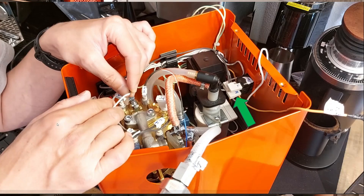What are the things you may forget if you just read the instructions? First, I think it's very useful to have flag connectors because they make a 90-degree angle and it's easier to route the wires in some cases. But to crimp flag connectors you need a special crimping tool, so you'll have to buy it — I'll leave the link in the description and in my checklist. You can use regular spade connectors, but it's easier and cleaner with flag connectors, especially for the wires connected to the power socket. You can reuse the flag connectors that come stock in your machine, or solder, or use bare crimp connectors. But if you're doing everything new, you'll need to buy the flag connectors and the crimping tool specific for flag connectors.